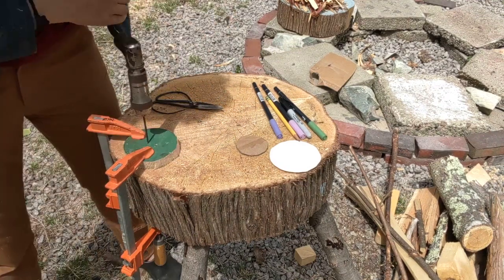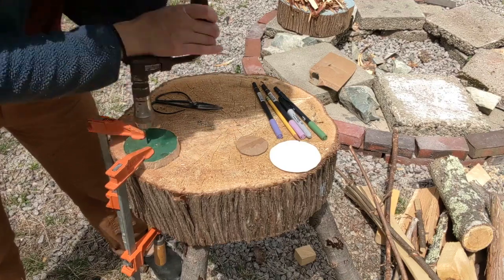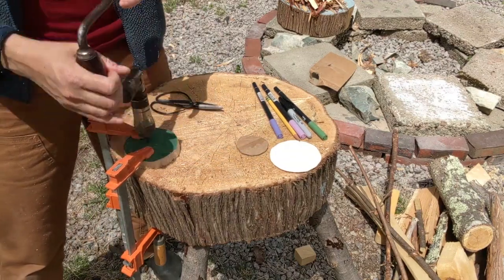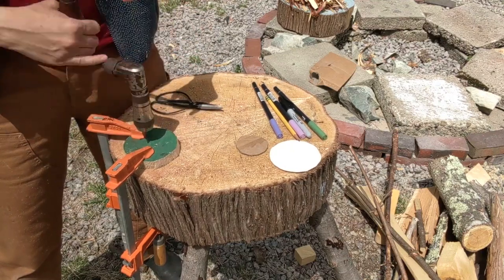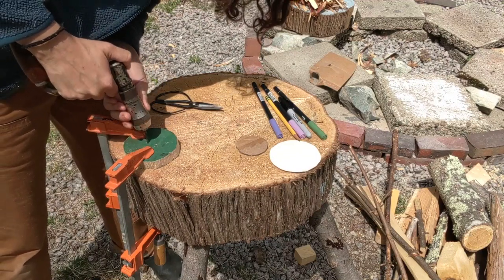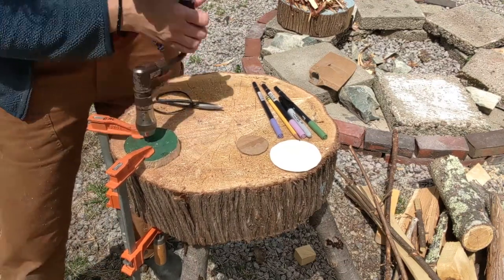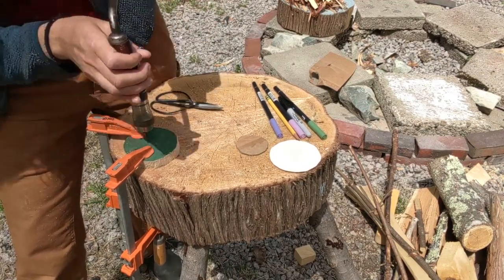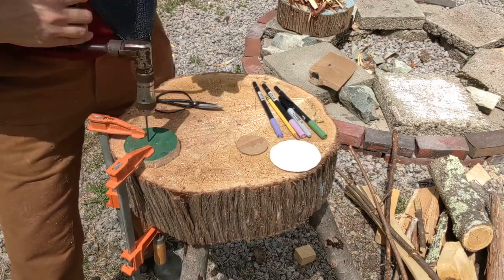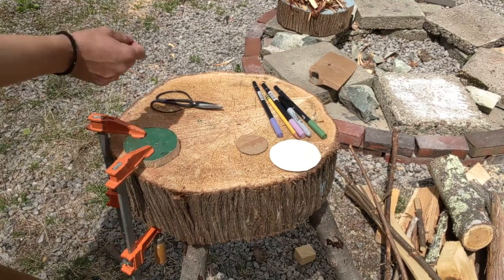So the first hole shouldn't be on center like I just said, but it should be slightly off center. The idea is that they would both fit into a ring, if you imagine a little ring in the center. You could even draw a circle. And that's how you know you didn't tighten your bit brace tight enough. So I'm gonna get it nice and tight on there, and try pulling it up and out. Just looking to make sure it's spinning. Okay. So have that part done.